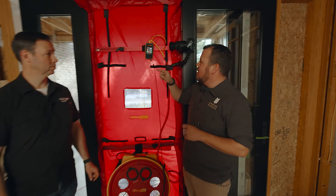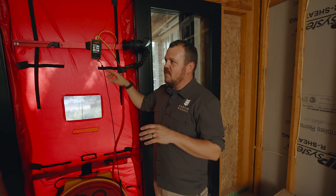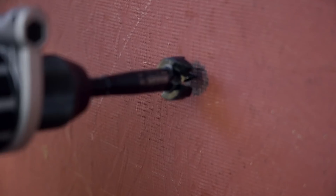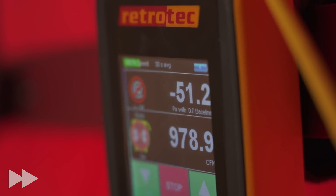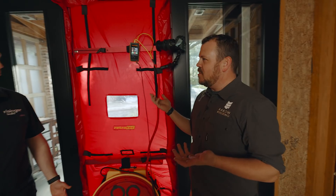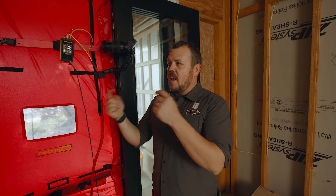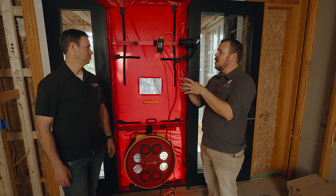We have our meter adjusted so we're getting CFM — cubic feet per minute of air moving through the envelope. Right now we're leaking at a rate of 954. So let's drill three one-and-a-half inch holes and see what that does. We drilled three inch-and-a-half holes in the back door that's missing its glazing for now, and we got basically 30 CFM — about 10 CFM per inch-and-a-half hole. The interesting thing is not every hole leaks the same amount of CFM, so it's not simple math. Let's drill a three-and-a-half inch diameter hole and see what that does.